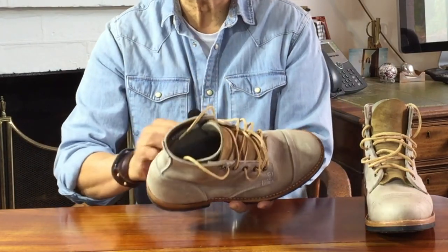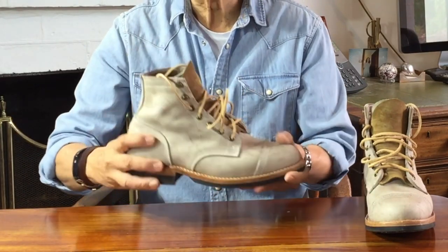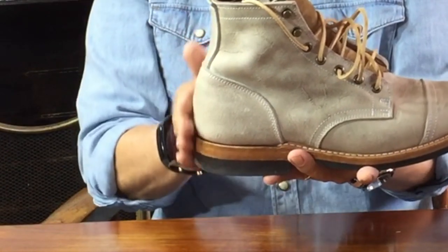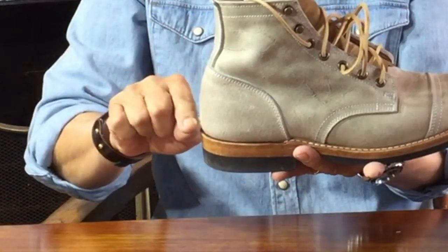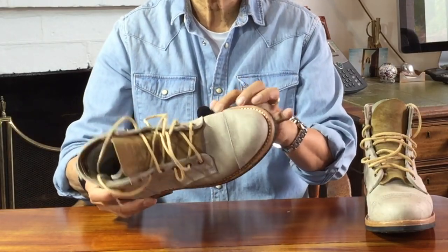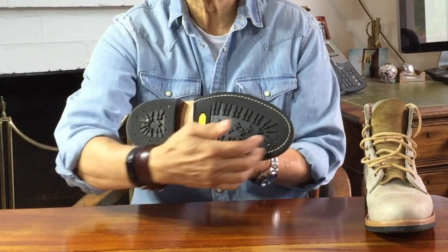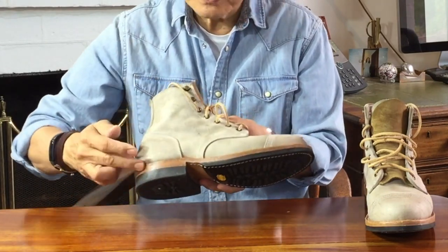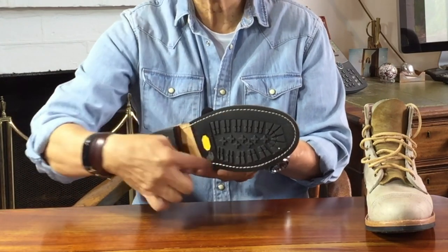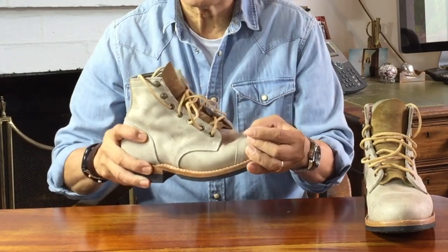The back one-quarter of the boot that's not welted is securely nailed and glued to the midsole. Not so water-resistant at the back, perhaps, but what that does is produce a tighter heel area that does two things. First, it looks slimmer — there's no protruding ledge. And second, it can attractively emphasize the welt up front, especially as in this case the welt is left in a natural color. The outsole in this boot is a rubber half-sole. The leather midsole goes all the way along the length of the boot, and a rubber lugged half-sole is glued and stitched to the front under the ball of the foot. This has the advantage of better grip and theoretically better flexibility.